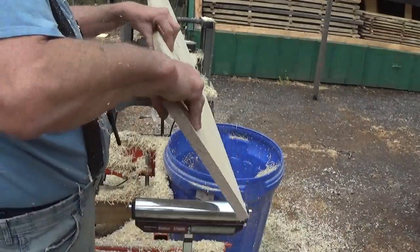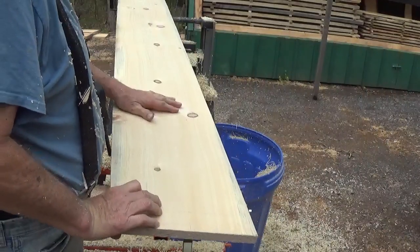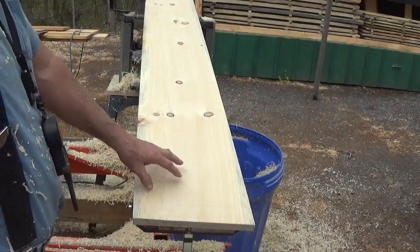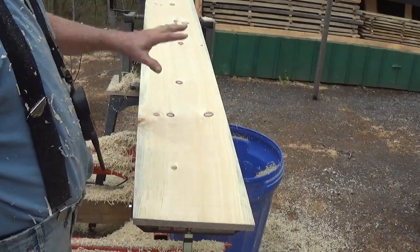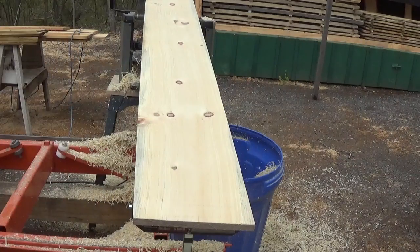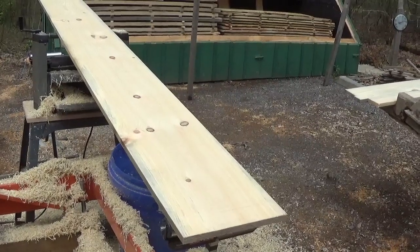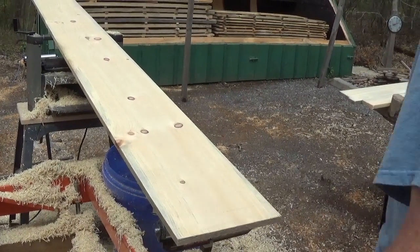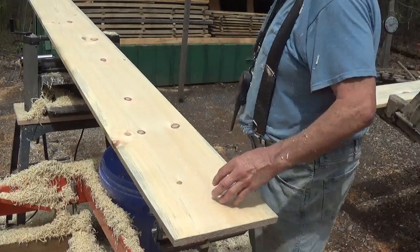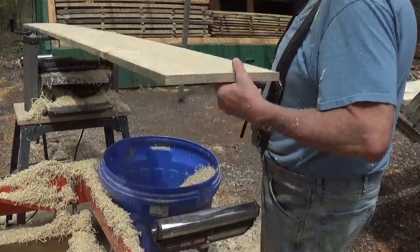The board basically is the same on both sides. Actually a little nicer on this side. So when I look at that, I say to myself, okay, this is the nicer side of the board. I'm gonna sacrifice whatever wood I have left on there and use the planer to take it off of that side and not worry about those two little marks on the opposite side. Because in reality, they could be sanded off. I've got about a 1/16 or less that I can take off of here, and I think that'll clean that up then.